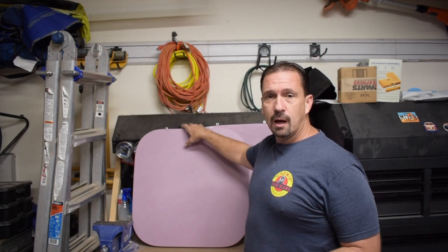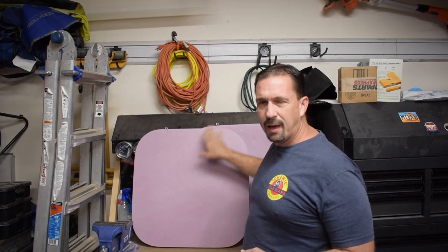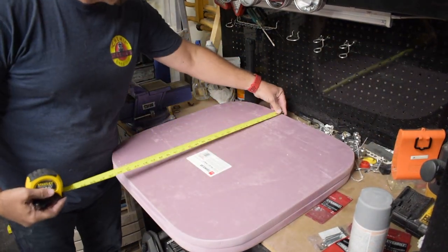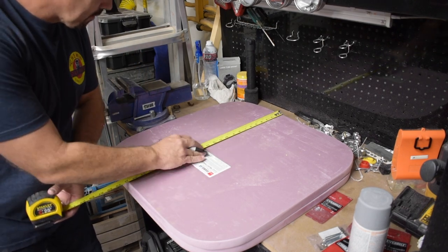We have two panels — I went ahead and reproduced a secondary panel to match using the same process. Our epoxy is dry. Unfortunately I had a little bit of a spill so there's a little bit of that, but we may work to cover that up later. Mostly we're just working on trying to find the functionality of them — how good are they? The next thing we're going to do is find the proper placement for the DML exciters that go on the back. There's an ideal placement which is going to be a two-fifths, three-fifths positioning on the back of the panel. This is roughly 24 inches, so two-fifths would be roughly here and three-fifths would be roughly here.